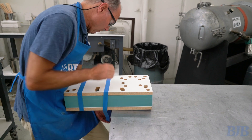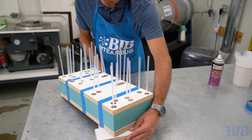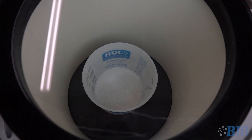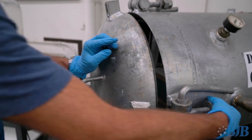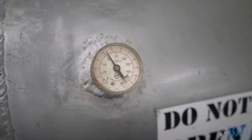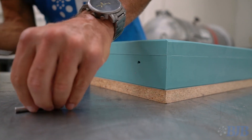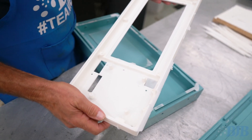I sandwich the mold with my bottom and top plate and wrap tape around three or four places. Angle the tool so your sprue is at the bottom and your vents are at the high points. For this part I'm using our TC 891 which has a work time of 12 minutes — I should have enough time to mix the material and put the mold in a pressure chamber. We typically use 60 psi for our castings. After about four hours we demold the cast part. I remove the vents, sprue, and four side pins. The part looks pretty good, though I see a couple of trapped bubbles that did not make it out through the vents.